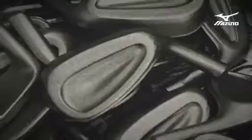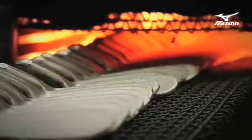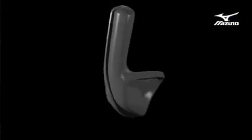We use a thousand-ton air hammer press. There is an unnecessary part we call the flash. We use a so-called cookie cutter to get rid of this flash. Then we heat up the material again to red-hot high temperature and put it in the second mold for pressure forging, squeezing the shape really slow and tight. Then we are ready to go to the grinding process.